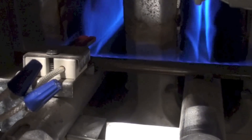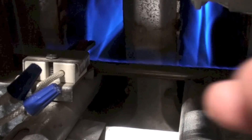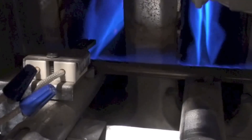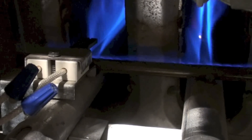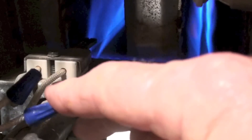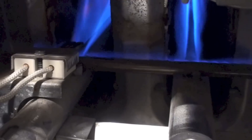One other thing while I'm thinking about it — these wire nuts here really shouldn't be positioned where they can see the flame. There is a cover that comes down over this area, so normally you can't see these wires. There are ceramic wire nuts you're supposed to use in these things. Sometimes they're hard to get to hold, but the standard ones will melt if you're not careful, so keep them out of the direct line of sight to the burners as much as possible.